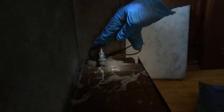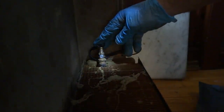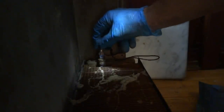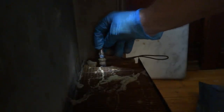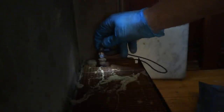Yeah, this is a copper convector. You can hear the air coming up now, right? And I got the heating system circulator running, so it's gonna circulate. Sounds like it's got gas. We'll go do all the other ones and we'll come back and hit them all a second time. You want me to leave the cover off so you can vacuum? Yes, please.